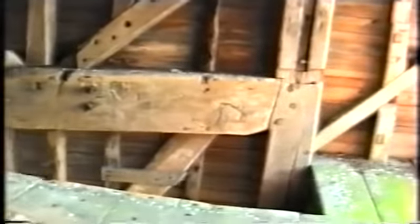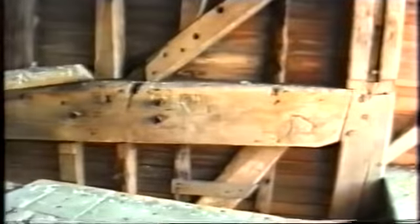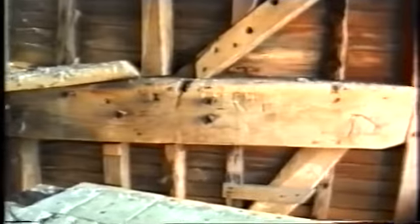There's a junction of the right-hand side girt with the corner post. Not too bad in condition. There's some initials carved on it. And once again these bolts, which seem to suggest that it had a metal plate on at one side for strength. And when it gets to the side girt, to the crown tree, good heavens, look what it's done. In fact, the side girt, far from humping up, is actually bowing downwards. It's completely broken in the middle.